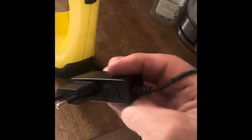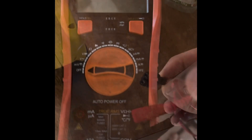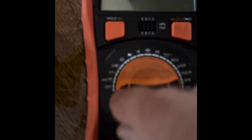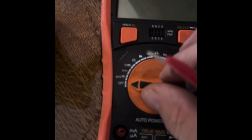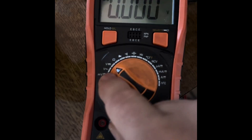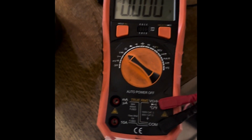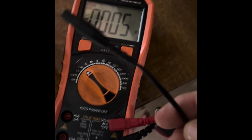Take a picture of the label on the bottom and blow it up to read the writing. It says the output should be 5.5 volts. So we plug that in and check we get 5.5 volts. I've got the universal tester here — we just need to put this onto volts DC, which is the straight lines. You've got volts AC and then the straight lines which is DC, so we've got that selected.